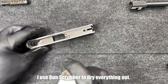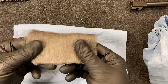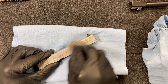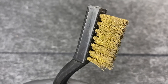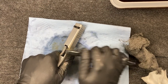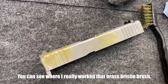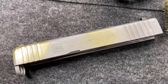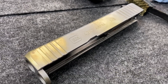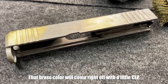Then I come back, pull it out, and use triple-zero steel wool — a very fine wool that's less likely to scratch and more likely to polish, but it does remove material. You have enough abrasiveness without destroying the finish. If you need more, when the steel wool stops doing much, you can use a brass bristle brush. My goal is not to take everything off and get into the factory finish — I just want to get down to where everything remaining is discoloration, not active rust.